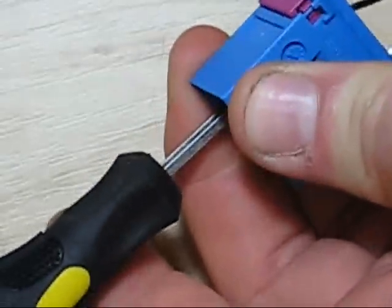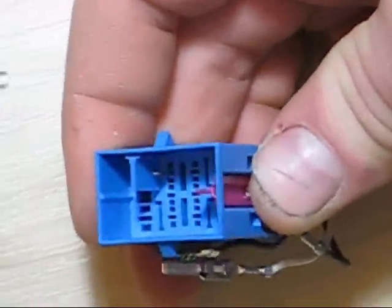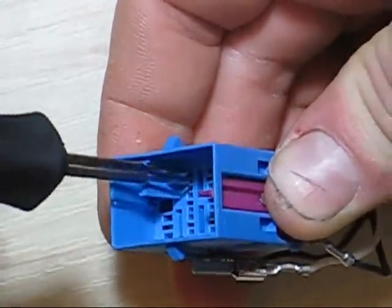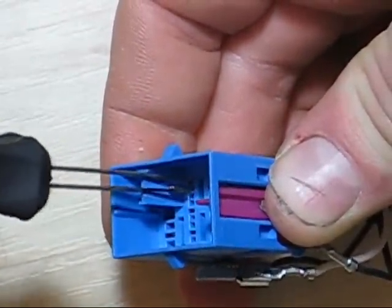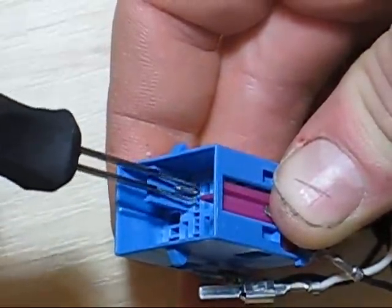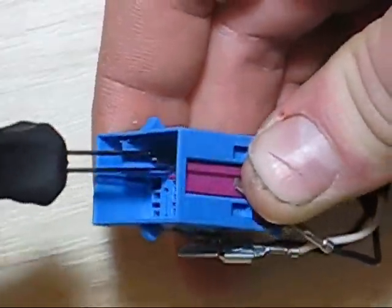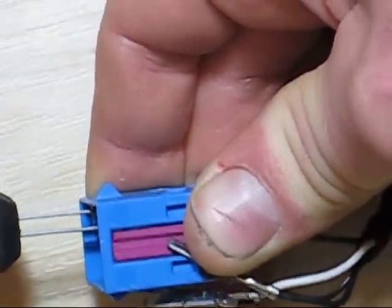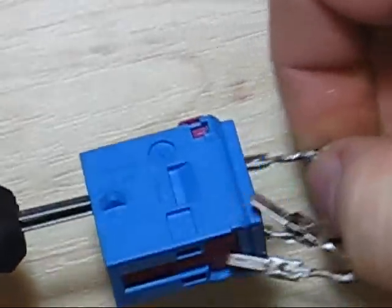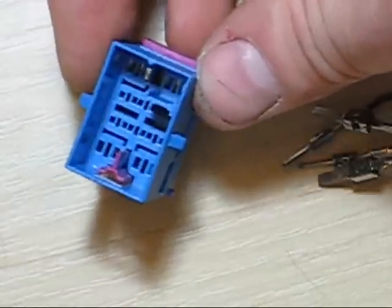Using the micro tool now - there's one terminal and one last terminal. On this particular type of housing, the access points are small holes directly above and below the terminal. I'm trying to insert the tool while looking through my video camera so I have no depth perception, which is why I don't look so coordinated.